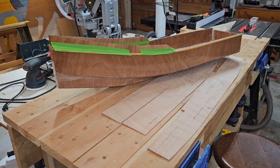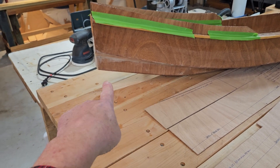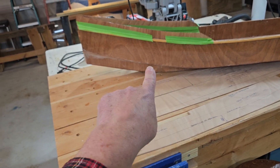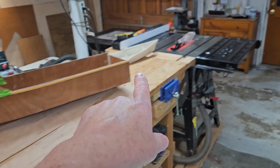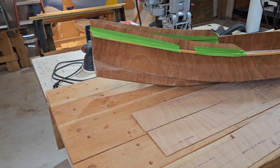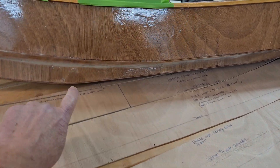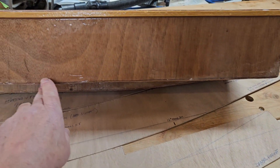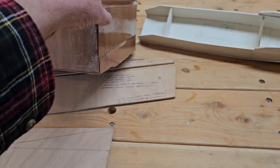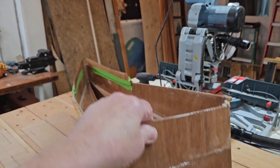This curve on the bow won't be shaped quite like this on the model — I'm going to go a foot deeper, so a sharper, taller bow. This part is curved more steeply than on the little model. I'll have the keel section more like the small model over there, which should make it better for going through waves. The goal is to have most of the boat's displacement taken up by the keel, so the waterline is just kissing the bottom going out, which doesn't create a lot of drag. This gives lots of stability, especially as you accelerate and the boat starts planing.